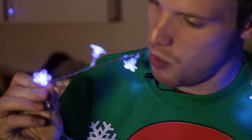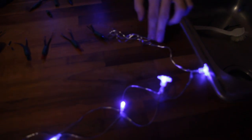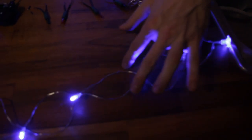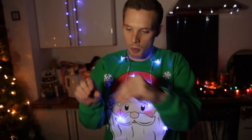The second type of circuit is known as a parallel circuit, and that's what these bulbs are here. I've got some down on the table — if I switch them on. What you've got is two wires coming out from the battery pack, and they actually go to both sides of each bulb, all the way around like that. So you no longer have a series going bulb, wire, bulb, wire, bulb, wire — each one is almost on its own little circuit.